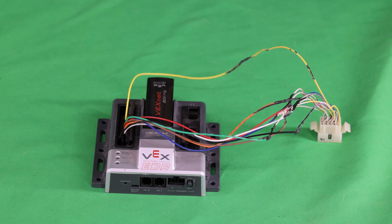It allows you to just use jumper cables, and you just plug them into the digital input port that you can see on the left side there with the wires coming out. The wires are connected to a 15-pin Molex connector that adapts to the original Hero 1 Teaching Pendant port. Again, it's a 15-pin Molex connector, but I've also used just nails sticking into the Molex connectors, and just soldering wires to that, and that worked too. So you can use whatever means you have to make the connections.